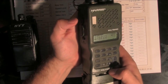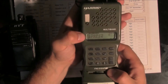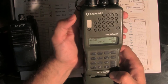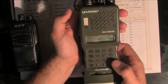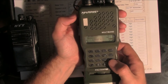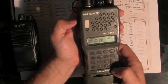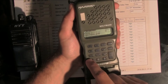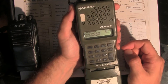The second thing: we are going to change our slot from VHF to UHF1. We are going to confirm that, and let's check if we could — yes, we can enter a frequency from the PMR range.